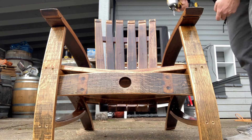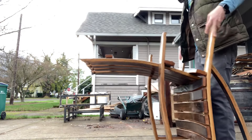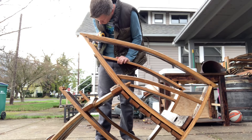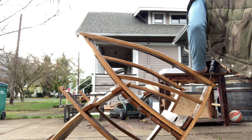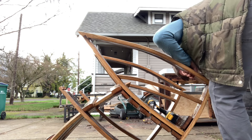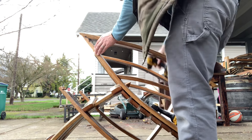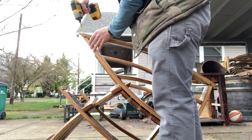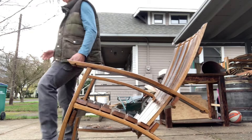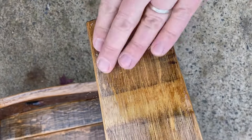Now this chair is officially done, unless we want to do finish work or we want to turn it into a rocker. So let's turn it into a rocker - flip it over. I had been intimidated about building a rocking chair until I learned that all it takes is putting two runners on and they fit perfectly, so you can make a rocking chair pretty easily. You definitely need to pre-drill here and really watch your connection because you can split all of these boards really easily. You're also going to want to inset the screw so that when it's rocking, the screw's not touching the ground because it'll scratch up your floor. Once you get the runners attached, flip it over and see how it rocks because you might have to adjust it.